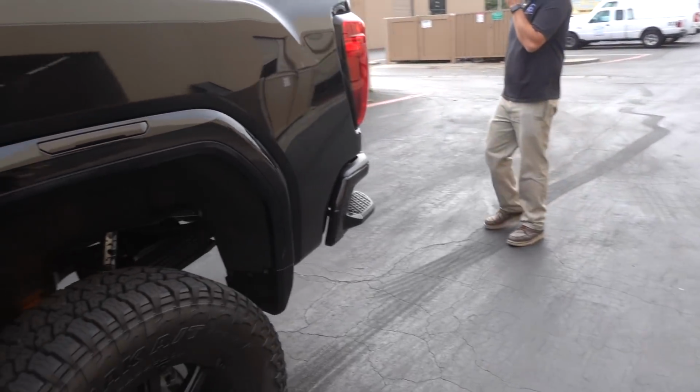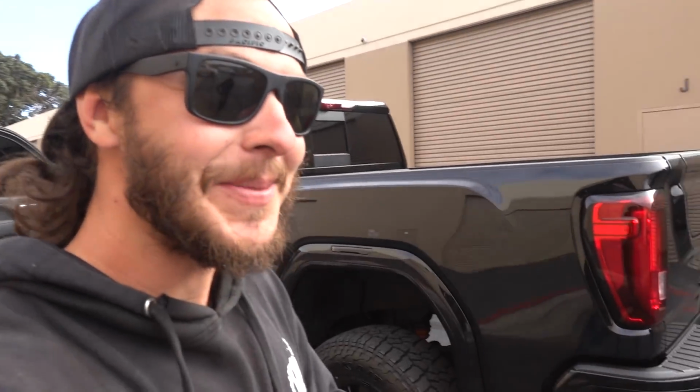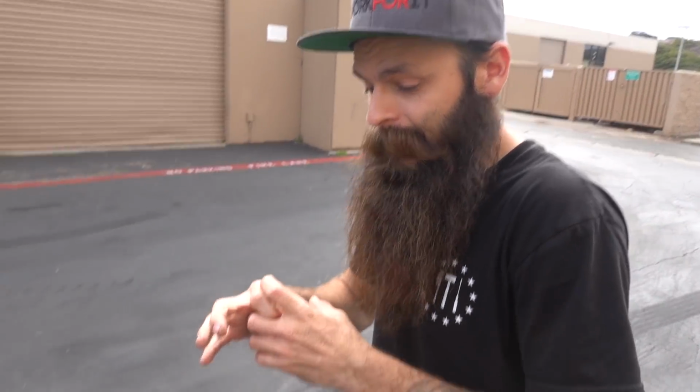Jeez. Good Lord. That's a 3/4 valve to 3/4 hose feeding into the 1/2 inch of the Nathan. It's got all the big dog shake. So on my truck, we were running 1/2 inch hose, right? That's what the orifice is there. So I did a 1/2 inch 90 into a 1/2 inch doubler into a 1/2 inch to 3/4. So the inside area of the 3/4 is what a 1/2 inch internal is. Gotcha. So a 1/2 inch external is how they measure the hose, so the actual 1/2 inch fitting's a 3/8. Gotcha. So this is true 1/2 inch.